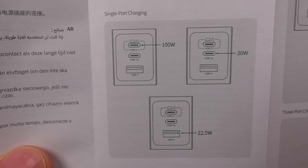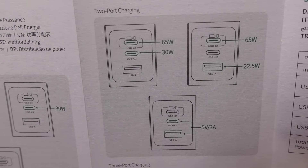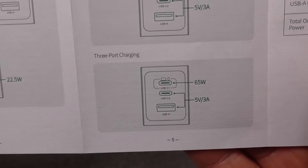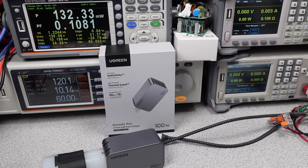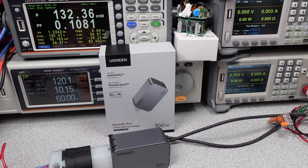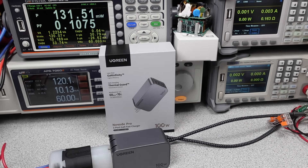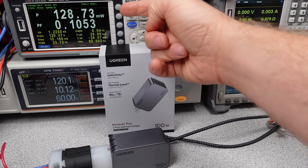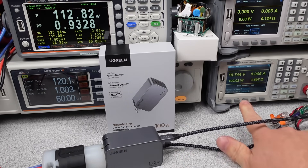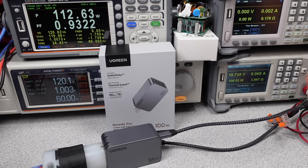Because of the power sharing, these USB ports will renegotiate on plugs and unplugs just like the 65W cousin. Once it all gets plugged in, it works as expected. The idle power consumption is a little higher, which is kind of surprising since it's not much different than the 65W with nothing plugged in — but it's still not terrible. Once loaded up, it operates about as expected, and it does have some off behavior when switching through the various modes, just like the 65W.